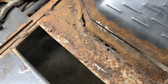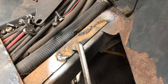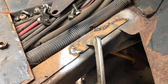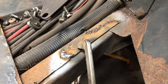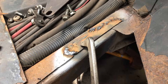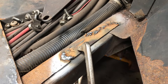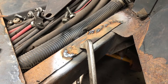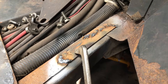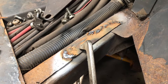When I started grinding that back I noticed that section was raised - you might have seen that in an earlier video. I beat it down but the metal just disintegrated, so I cut out a piece and cut out a patch. The patch is now welded in there. I'll just grind that down, give it a coat of primer, and that should be ready to start putting in the rest of the bits.